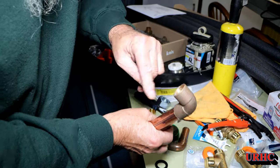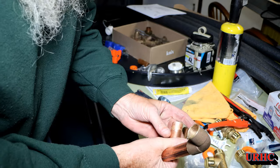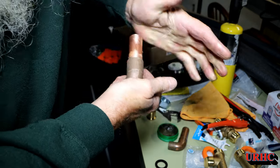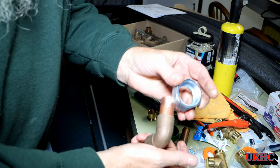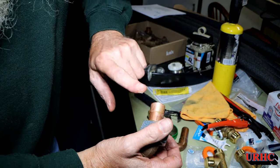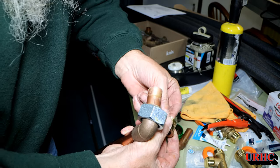You want to make sure you get plenty of the correct soldering paste on each joint on both sides before putting it together, then wipe off the excess. I've got a brush for this paste but it's like Vaseline thickness so it's hard to apply. You can see that new tubing — for what you pay for it, it's just not perfectly round anymore. Here's the dielectric elbow fitting; I'm putting the metal piece on because I'm doing a very short stub, and I'll put the plastic piece back in later after I cut it.